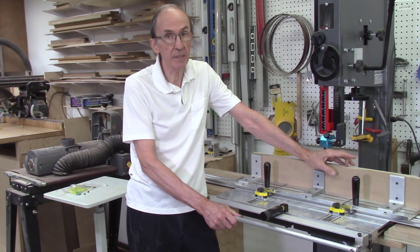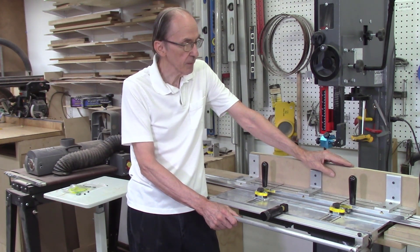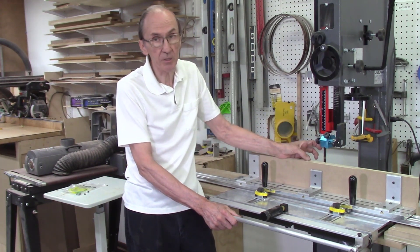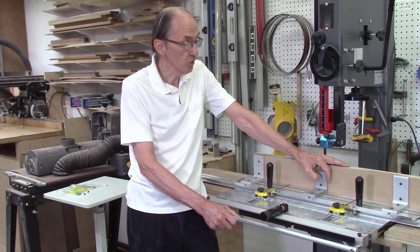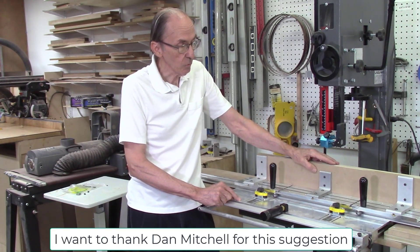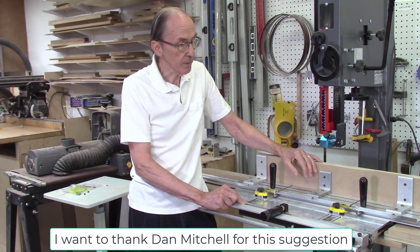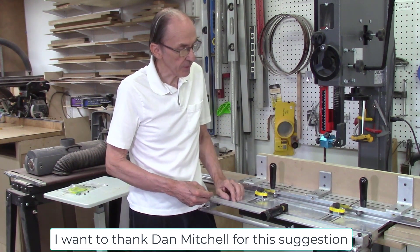Working on the latest video on the automated AccuSlice system, we cut some boards that were six inches tall, 36 inches long, by two and a half inches thick, and I got a variation of about three to four thousandths of an inch — a little more variation than normal. The question is, can that be improved by putting some sort of bearings on this plate? When working with Dan, we discussed several ideas including ball bearings underneath the plate, and then the other idea that came up was using some sort of point bearing, which is probably a better option.